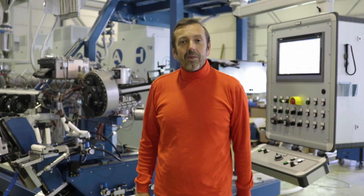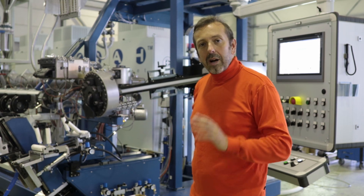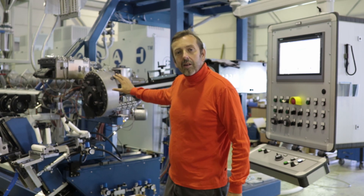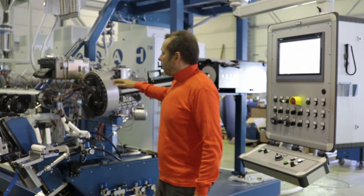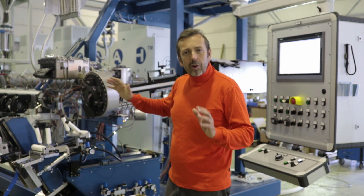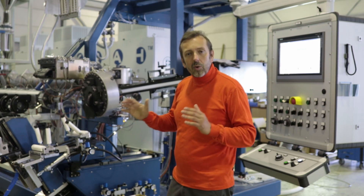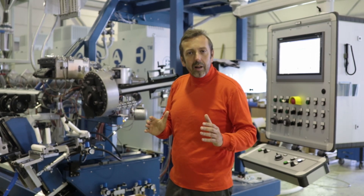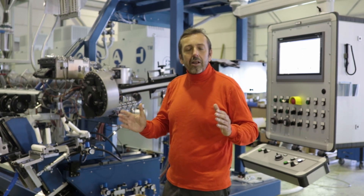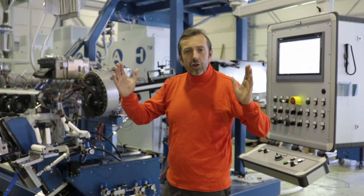Here we are — this is a machine at the moment under construction, so it's not a complete machine, but very good. The coating die head is already working. The second die for the waterway wall we will not use, so we concentrate just on coating the core tube so that you can see how we make the profile in a very short distance. This is one of the biggest advantages of the core tube: we can make a stable profile in a short distance.